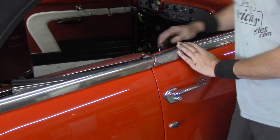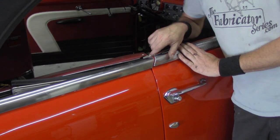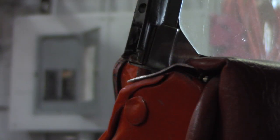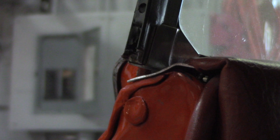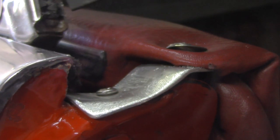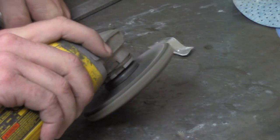So file very, very lightly — you want to try not to hit the chrome, the upholstery, or the paint, you don't want to destroy that. We'll get it all fit checked up again. No significant sharp edges, nothing crazy — you've got to make sure it's not going to tear somebody's elbow open if they hit it. Now we're going to take it out and get into the fun spot, which is metal finishing.